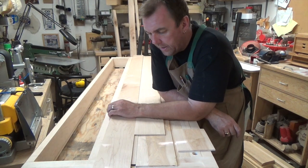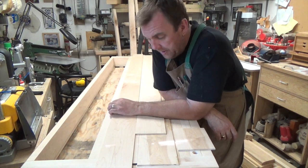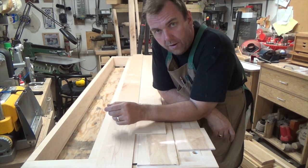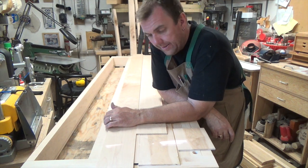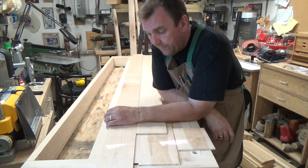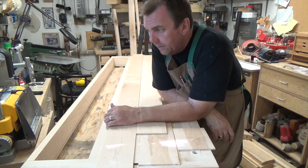So what I've got here is a bunch of offcuts from the resaw, planed down to three-sixteenths of an inch. I've got them cut to various widths so that the joints will overlap, and I'm going to laminate these together to give us the bottom of our tool well. It'll be maple so it'll match right in with the bench, as opposed to throwing a piece of plywood in there. Now we wait for that glue-up to dry, and when I come back I'll be cutting the tool well bottom to size.